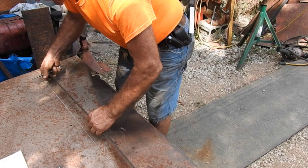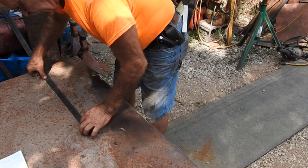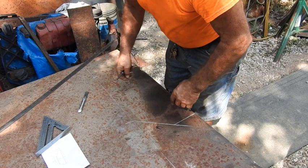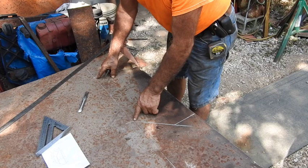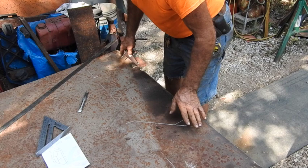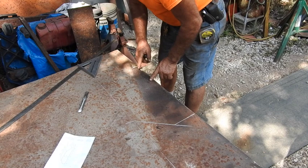Just pick an arbitrary center spot, measure back eight and three quarter inches, measure over eight and three quarter inches, and that should give you 17 and a half total length on top. My card filled up so I got lost and laid this out without filming. But at any rate, we laid out the 17 inches up here at the top with the center line, transferred the center line down to get the full 28 inches needed because of the diameter of the tire. From the edge of the 17-inch mark, I marked a 45-degree angle down here, and at the 28-inch mark off of the center line — the 14-inch mark — we square it up.